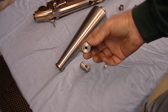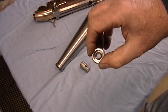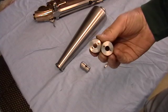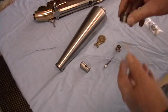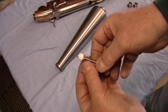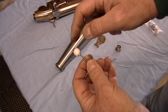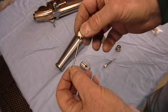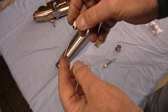The valve head, as you can see, has the two pinholes. The valve seat is tapered, and I've made various ones to test different things. Different orifice diameters, different valve seat angles, different inner diameters for shrouding. The valve heads are basically a Delrin. I take some 1/4-inch water hardening stock, machine that, thread it on the end, make a nut, and then I use a drill reamer blank as the rod itself.